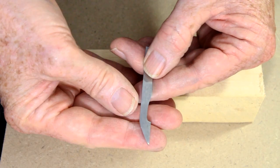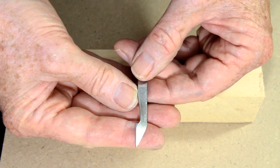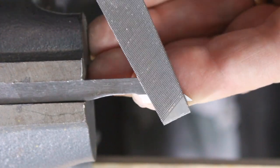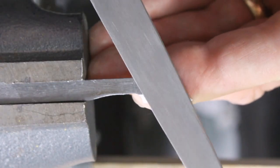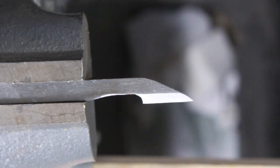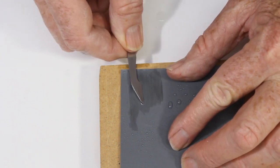Once the outline is where you want it, then you need to taper the sides to form a cutting edge. The safest and most controlled way of doing this is with a file. To support the small blade while you shave off layers of steel, I've found that filing against my finger works pretty well. After rough shaping, you want to remove all the tool marks and scratches.